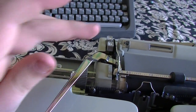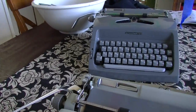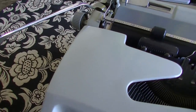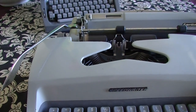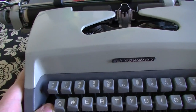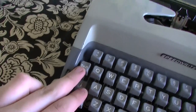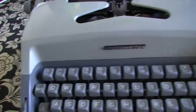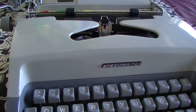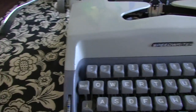The only thing I'm still working on right now is there is a bit of a clutch system for the tabulator that's worn out. There's a system that pushes against a plate in order for the carriage not to slam to the left when you press the tabulator, but everything is pressed together and pressing against the bar, which makes it incredibly tight and very difficult to tab. Sometimes when you click the tab the carriage won't move and you have to release the tab slightly and then it will move over. I'm working on fixing this — I think I need some new material for that to rub against the bar in order to have it work properly.